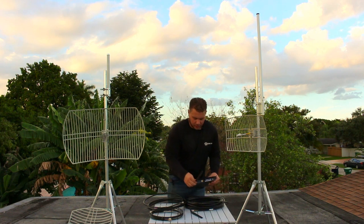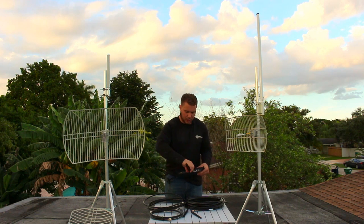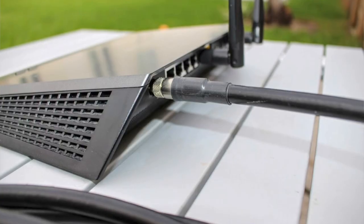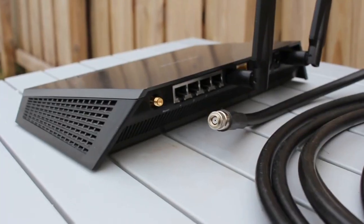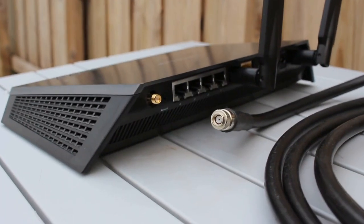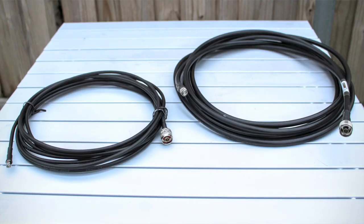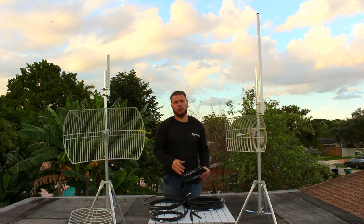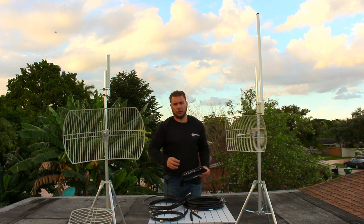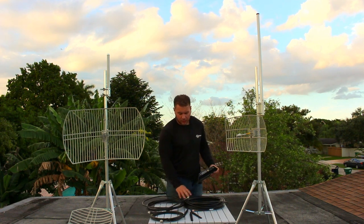Today I'm going to take these three antennas off and show you how we can connect three different types of outdoor antennas using coax cable with the SMA RP connector. We have a 240 type which is thin, and then after 20 feet we always recommend going up to a thicker jacket on the coax — that's the 400 type. We have a 20-foot and a 60-foot cable.